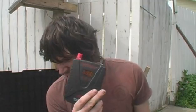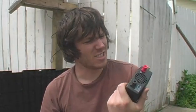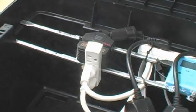My great idea with the 400-watt inverter turned out to be garbage — it just cuts out every time. I think the heavier cables might have even made it worse, maybe drawing too much. I think this inverter might be designed for use in a car, not off a standalone battery. Pretty disappointed, but I did have an older 175-watt inverter that plugs into a cigarette lighter, and things are working off that setup. Now I just have to figure out if everything will run off just the sun.